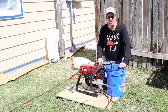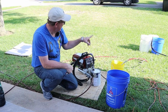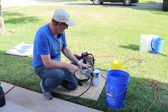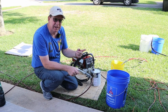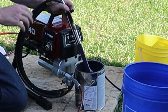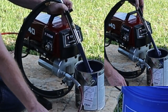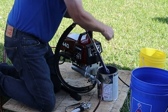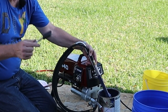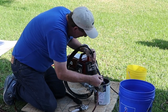Now let's show you how to clean it up. I'll put some paint through here and show you the cleaning techniques. I've got four or five gallon buckets about half full of water — that should be all we need to get this pump cleaned. I also have a small bucket with the tips, guard, and handle in it. First thing is to get all the paint out of the hose and pump. I'll hold the tube up above the paint, let it run out, turn it to prime to get paint out that way, then turn it to spray and pull the trigger to empty it. I'll use a foam brush to wipe off the paint — less to clean and more paint recovered.